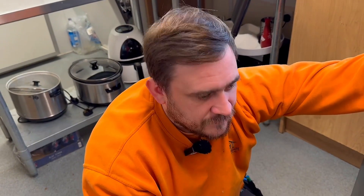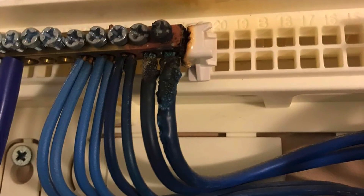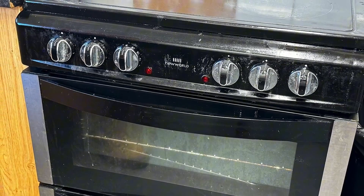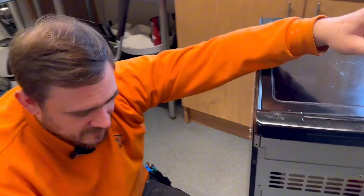We're probably going to go for a C2 — potentially dangerous. That's guided by documents like the Code Breakers and Electrical Safety First documents, where a plastic consumer unit with signs of thermal damage is recommended as a C2. This is a similar situation — there are obvious signs of thermal damage. We spoke to the customer and they said they're actually replacing this oven — the new one's coming tomorrow and I'm going to connect it. I'm still here doing the EICR over a couple of days on a big site, so we're going to replace it while we're here and it won't be used in the meantime. Maybe that swayed my C2 over C1 decision.